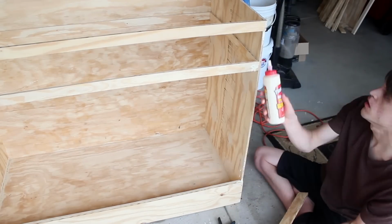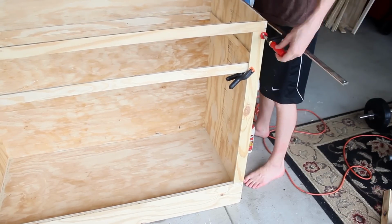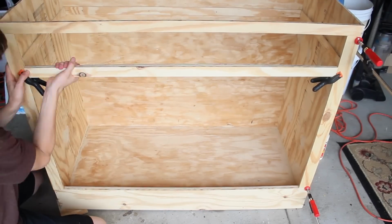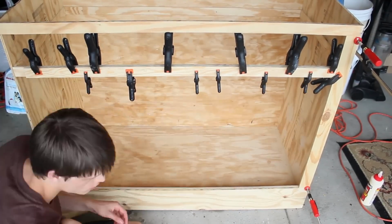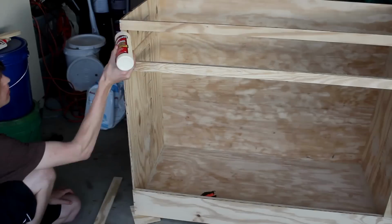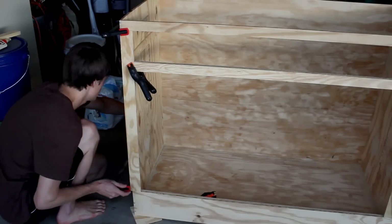That said, these boards are for the front of the sides of the enclosure, one of which was attached using wood glue and clamps. Then a 1-inch strip was attached to the front of the strip that creates the light compartment. Once both of these boards were in place, the other 1 3/8 inch strip was attached to the left side.